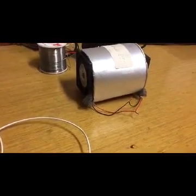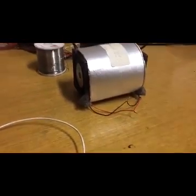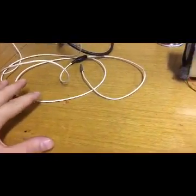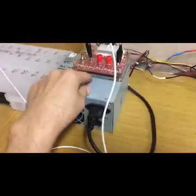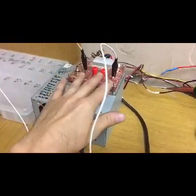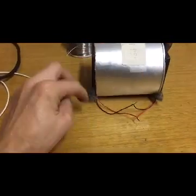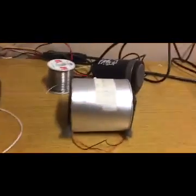So we're going to put permanent leads on the connectors, solder everything in place, and heat shrink it, and then we should have no problems. A thought just occurred to me: when we used the 24 volts to light that steel wool on fire, as soon as we made the connection, it was a short to ground. Because the Dangerous Prototypes box has protection built into it, if you're short to ground, it automatically shuts itself off, and then you have to manually turn it back on. So even if we shorted this out, would this burn? Yes, but the fans would immediately shut off, so we wouldn't get this chaos of fire out the back.